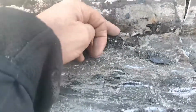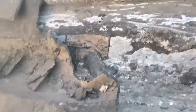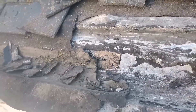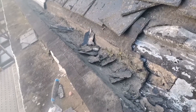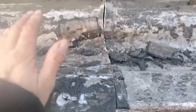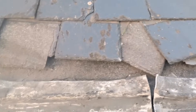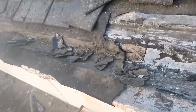Why? Because there are holes dotted around in various places. There's another patch there that someone's done in flashband in the past. So instead of spending a few more hundred pounds at the time when this was done — because lead would have been pretty cheap — they probably could have relined this quite economically, but they decided to leave the old lead in and just cover it. Our job now is to rip it all out and put in an under-eave course.